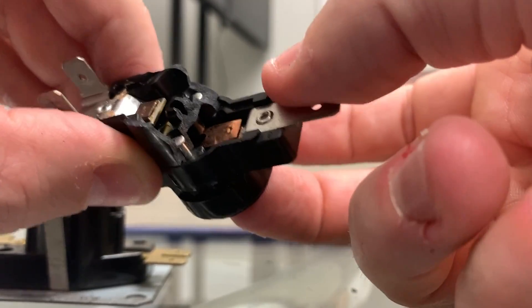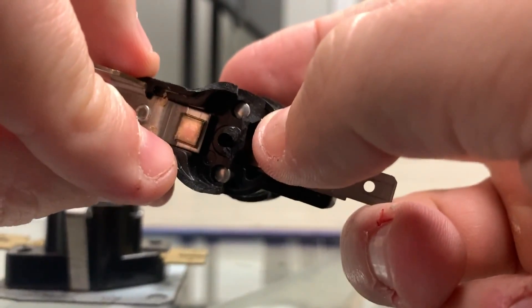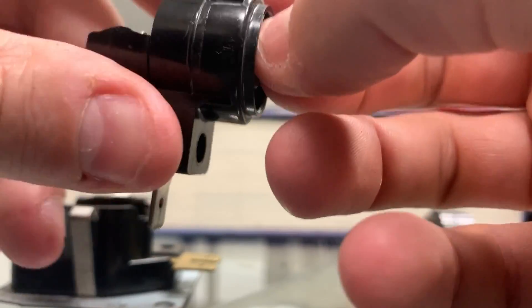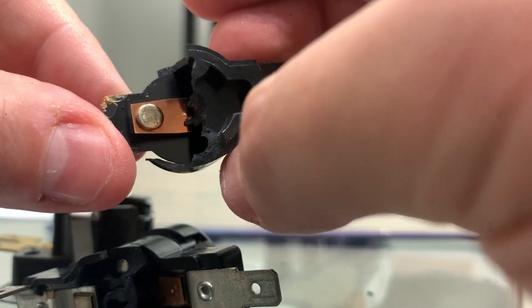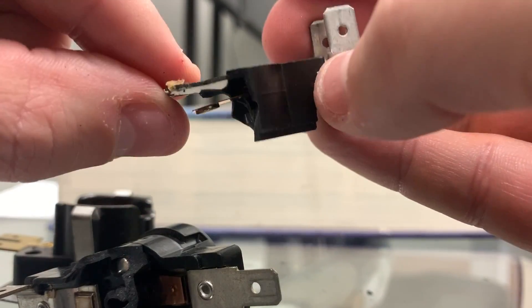It's actually a fairly highly rated contact. You can tell just by looking at the contact pads — the points on these — that they're pretty heavy duty in comparison to what you'd see on a small relay, like a 9340 or 9380 or something like that. And that's why a sequencer can handle more current than a typical relay would.